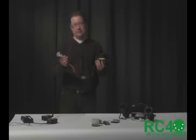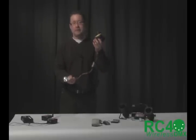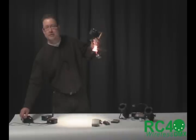So this is the power flow really in using any RC4 Magic dimmer: find the power source appropriate for the load. In this case, you've got a 12-volt battery and a 12-volt lamp. Put the dimmer in the middle, assign it to a DMX channel, and now from a DMX console, live in real time, I can control that light just like any other light in my show.